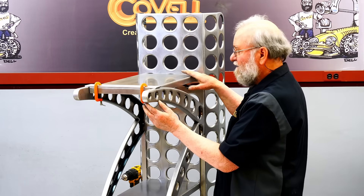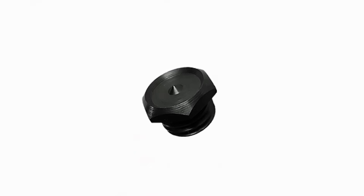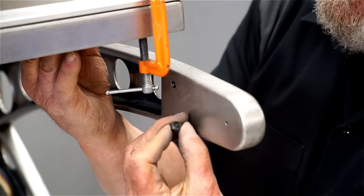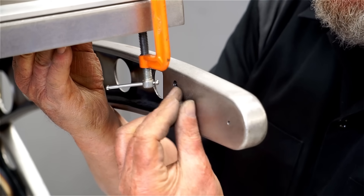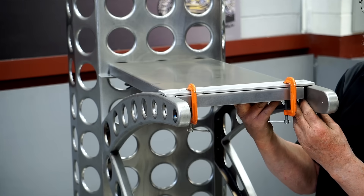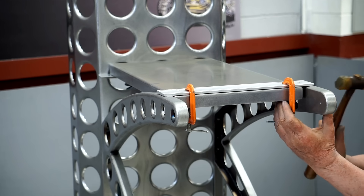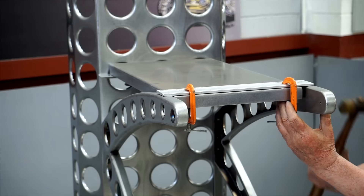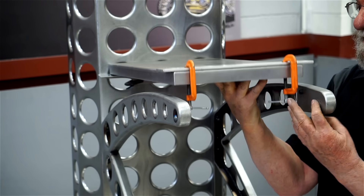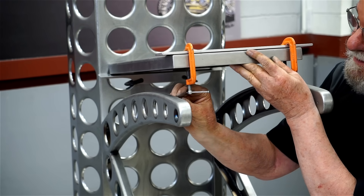The back is mounted, now I need to make the holes for the front. I'm going to use a tool called the transfer screw. This is designed to fit in a 1/4-20 hole, the hole size we tapped in this side piece. I'll screw this into place and put the shelf down where it goes. Then to mark the center of the hole, I just need to tap this side piece, and that will make a mark right in the center where the hole needs to go. I'll pull this transfer screw out and do the same thing on the other side.